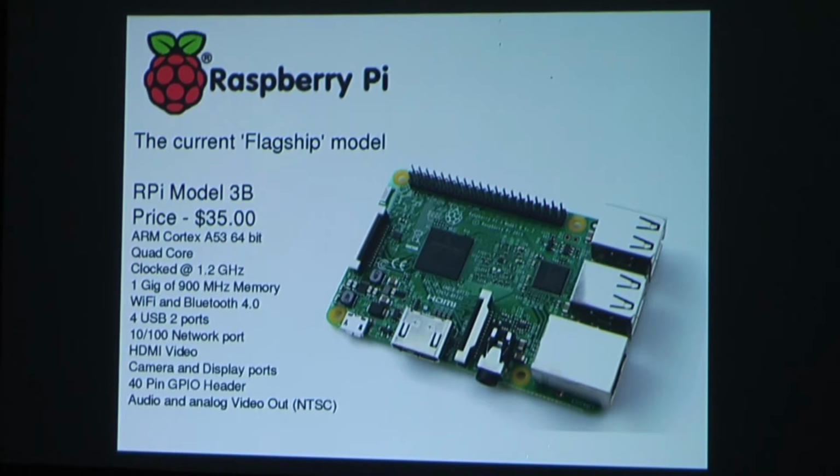Is the Wi-Fi antenna built on the board? It's right there. It's a little dielectric antenna. It's got a little chip right there. A 2.4 gig quarter wave is about that big. That thing is about the size of a grain of rice. So obviously, your range will vary because of the physical limits of antennas. But in my office at home, I've got my little workbench where I do these little projects, and I've got a Wi-Fi access point right in my office, so I don't really have any problems. I brought it out into the kitchen last night to hook up the projector and make sure everything worked. And I was down a bar, so I really can't complain. You're not going to get a lot of distance out of it, but it's there.